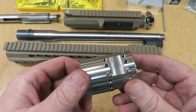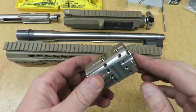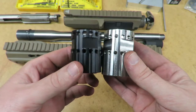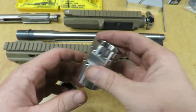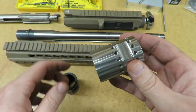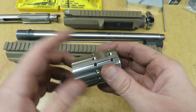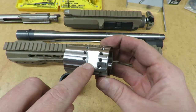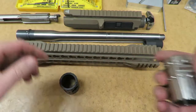There it is — all finished and ready to go. All done inside, chamfered, cut the threads to the appropriate length as well as the front. I did make a couple of changes to this one as opposed to the factory one: you can see it's a little bit longer. I actually sized this one according to the relief on the hand guard to maximize that full space. The thickness on the front is a little bit more because the outer diameter is about five thousandths more to get a nice snug fit with the hand guard. I reduced the inside diameter about fifteen thousandths to match closer with the barrel and give us more threads to tighten the screws down with. I also widened these notches here a slight bit so we have more coverage with a wrench to get it good and tight.